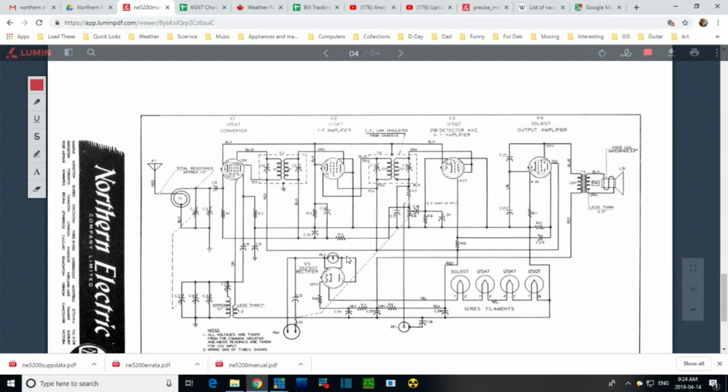So people, I've heard over the years that these lights are in the radio doing two purposes. And the story I'm about to tell you, I don't think is true, but this is the common story, that the light helps buffer the tube filament away from the inrush current that's coming in. And this protects the filament inside the rectifier. If this bulb is burned out, then the protection is lost, and you're going to wear this out that much quicker. So you need to replace the bulb quickly. I don't think that's the true story.